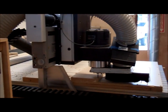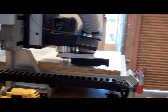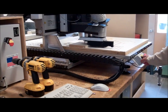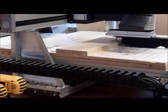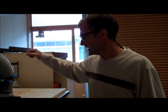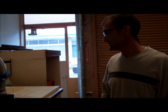Everything's clear and safe. I have glasses on before I start it. I'm going to keep my hand over the pause button when I run it. Because I have that bit zeroed in the lower left, I'm going to get perfectly square parts that I'm cutting out. I really need to keep my finger near that pause button so I can stop it at any time. And I'm going to hit start.